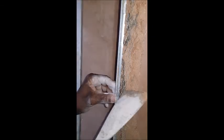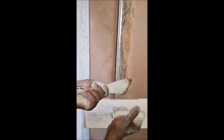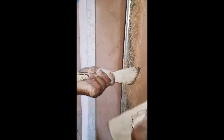So the bit that people need to be careful not to damage is this ridge. It's just a ridge here. It doesn't matter if you damage this part, you're going to slightly bend it back in like that and plaster it, and it will stay in. There we go. Cool. If you push that back in, you get enough plaster over that and you're done.